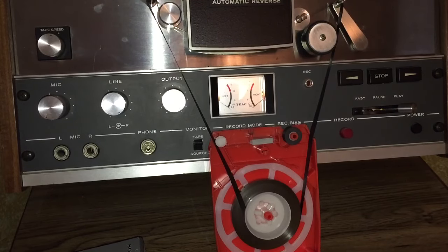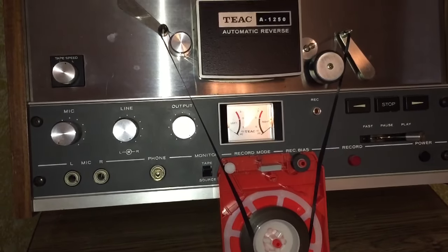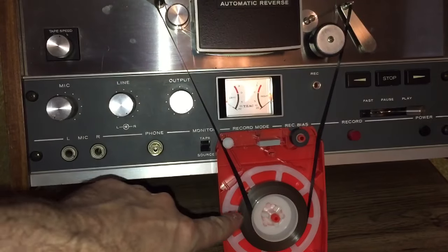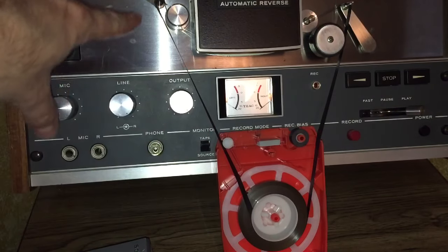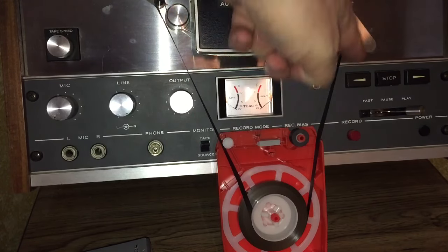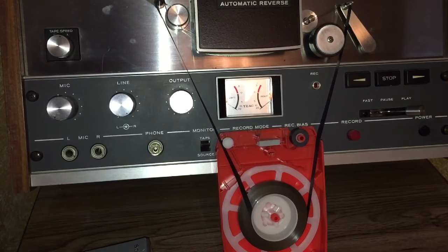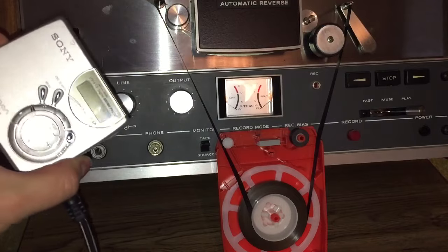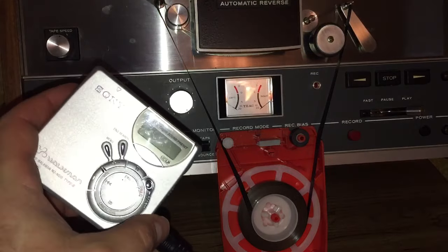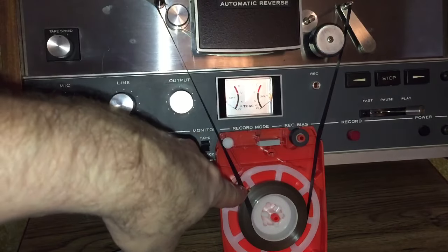So this is what it was like to take the soundtrack or the tones off of this original Commpak 8-track tape, as I have them hooked up to my reel-to-reel like this, which you can see there. So you take the supply side of the tape, run it across the heads, up and around the capstan and pinch roller and this other guide right up here, and then spools back down and goes to the take-up side. So what I'm about to do is take my soundtrack that I created on mini disc with the correct left and right channel configuration and re-record it back onto the tape.